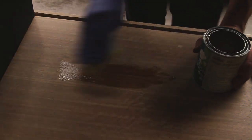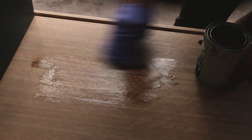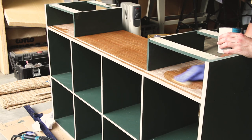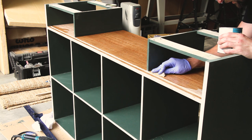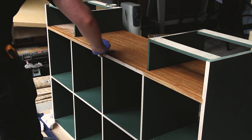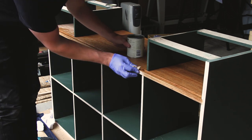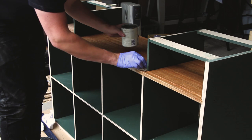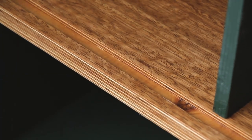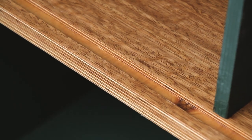For the finish on the veneer plywood I used a hard wax oil. This is a finish generally used on flooring but leaves a very hard-wearing, waterproof, waxy hard surface and really brings out the timber very nicely. I just apply that using a non-abrasive scouring pad — one coat and then a second coat after a day, and that's pretty much it.